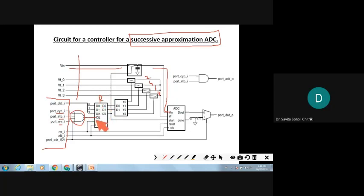The register's chip enable is connected, but the problem is the address that comes, which is an 8-bit address, A0 to A7. This A0 is the controlling address; that's why the port address input considers only the 0th bit. Only when a valid 1 is coming on this line is the chip enabled. So the least significant bit has to be 1, and only when A0 is 1 does the chip enable.